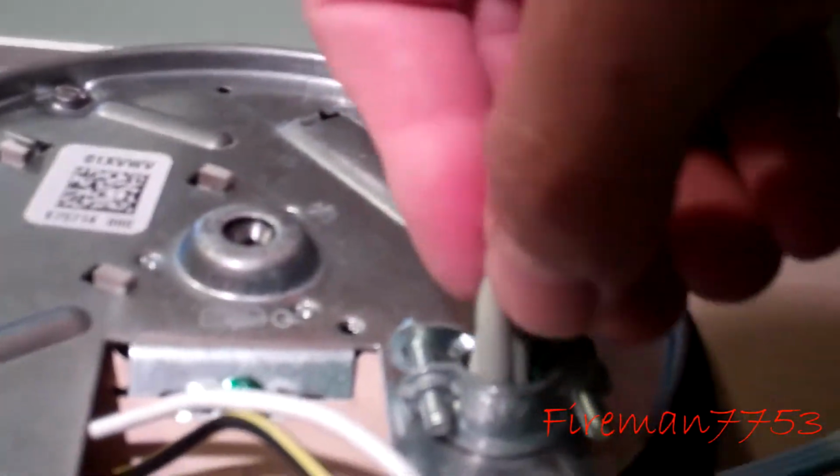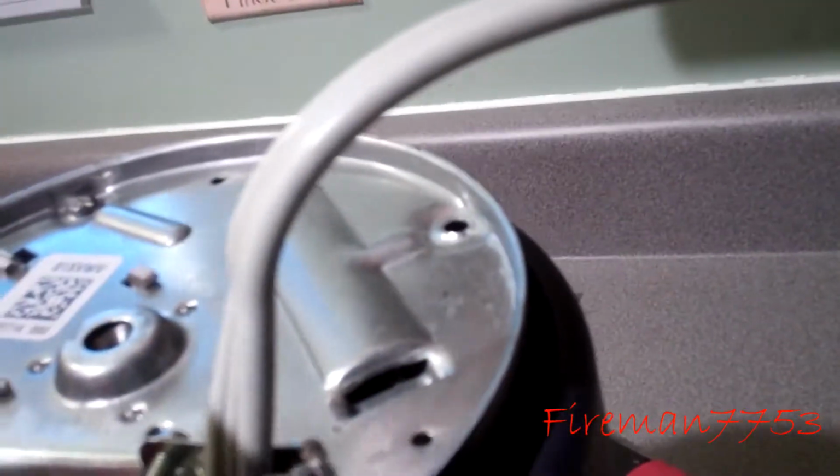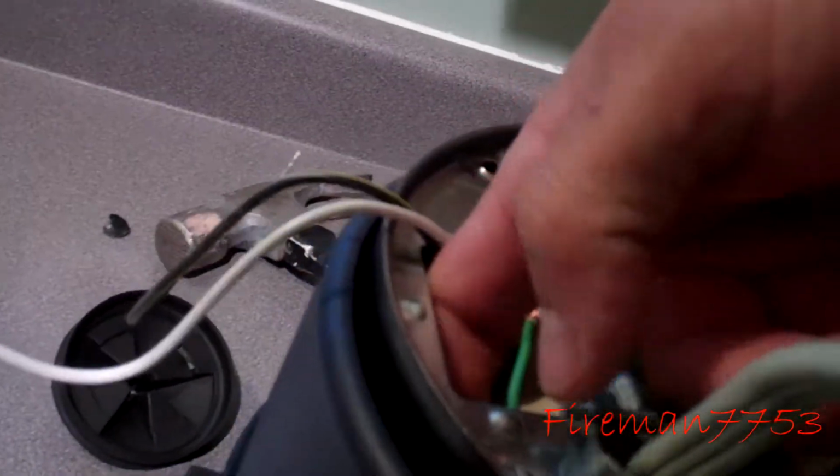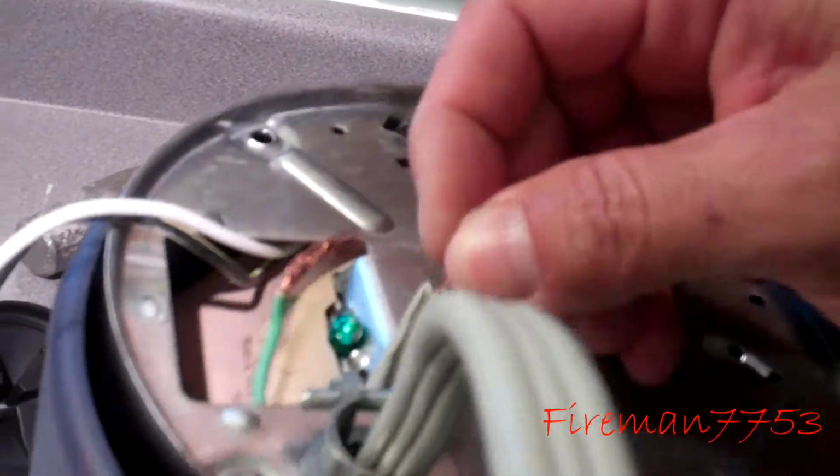I mean, it doesn't take a genius to wire this thing up. It's 3 wires. You got your hot wire, and your common wire, and your ground wire. So, yep, I'm going to have to use 2 hands, I think, here. We'll come back. Alright, so we got our cord in there. So we're going to get it centered up, tighten these guys down, and it's pretty simple. We got a ground wire that'll go to this green nut. And then on this guy, it doesn't really matter.